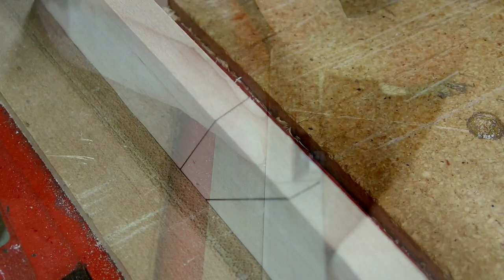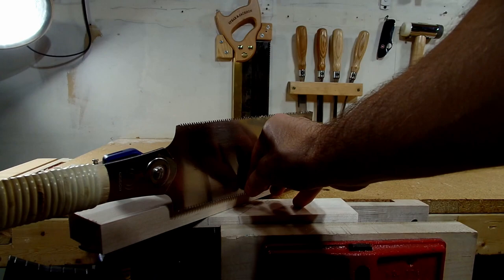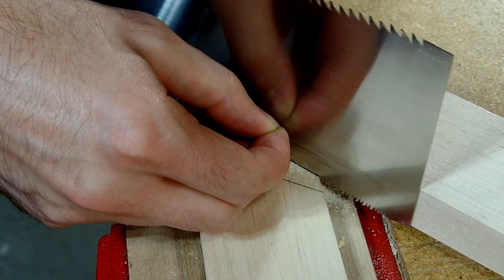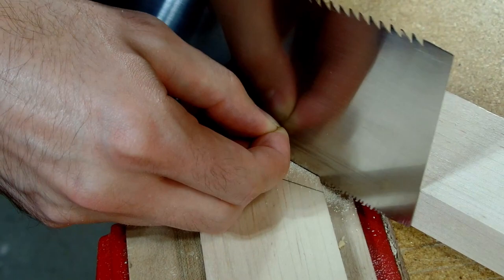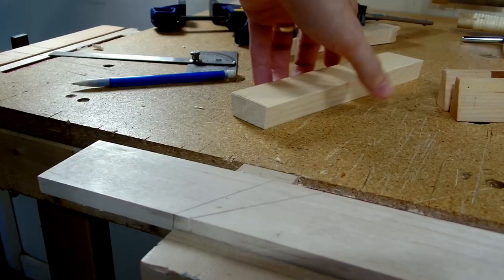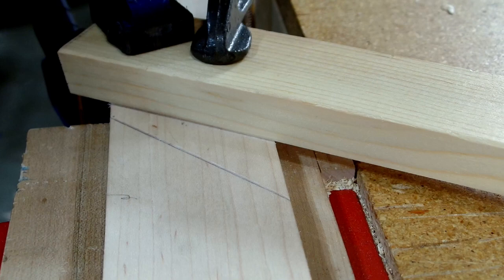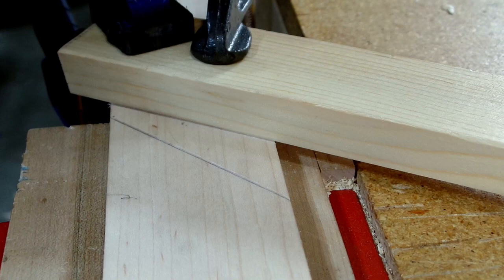All that is left for the layout is to mark the depth. The depth line is set to a quarter inch, since I'll be using this plane with a quarter inch chisel and want the edge of the chisel to be flush with the face of the plane. If you saw my last video, you know I used a square piece of block to help ensure I'm cutting perpendicular to the face of the plane — I liked the results so much that I decided to do the same on this one. And if you watched my last video, you'll remember I freehanded the wedge angle and didn't quite get the results I wanted. So this time I made a guide to help ensure the angle I'm cutting stays the same during the whole duration of the cut. Unlike last time, I was way happier with the results using this guide. It does take a little more time to set up, but the time is worth it with the results I get right off the saw.